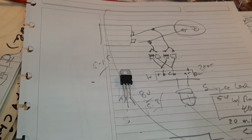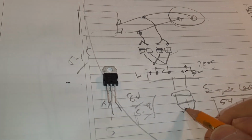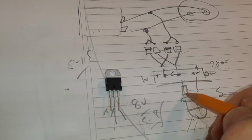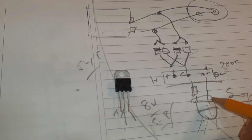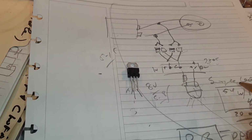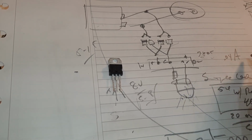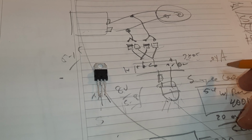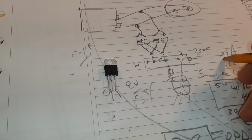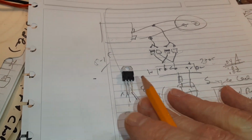Very simple. And I've been studying how to power and run LEDs to get the maximum light. You have to put a resistor in circuit to keep the milliamps controlled, or you'll burn this out prematurely. The milliamp limit that they talk about is 0.04 amps. And what we're looking at is 0.02, maybe 0.03, but if we stay below the 0.04, this diode will last a long time.